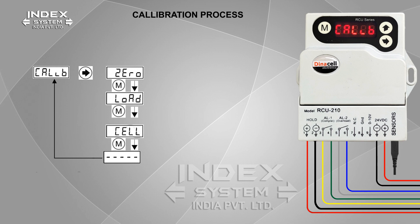Go to the calibration submenu and access its parameters by pressing the right arrow. For zero weight calibration process, select submenu zero by pressing the right arrow. Change the countdown value if desired, using the right arrow to shift the digit and the up arrow to change the number.